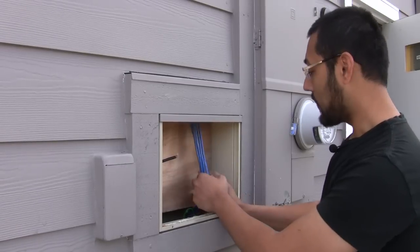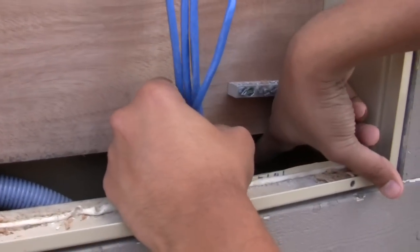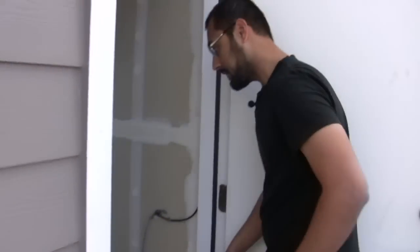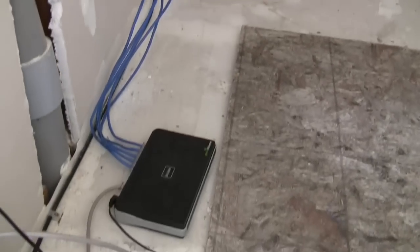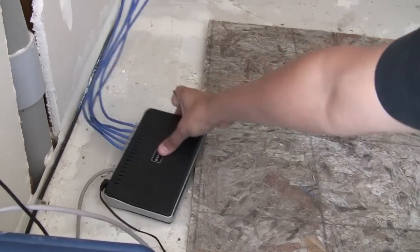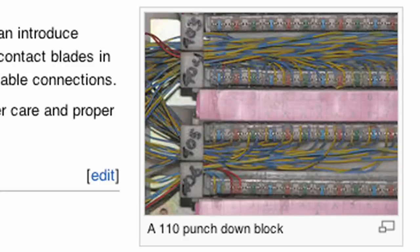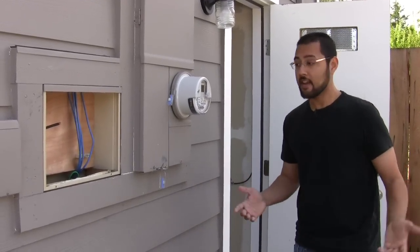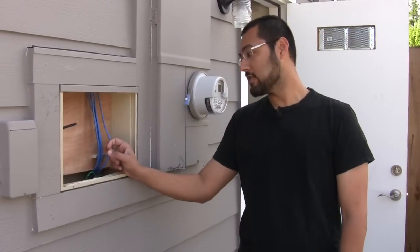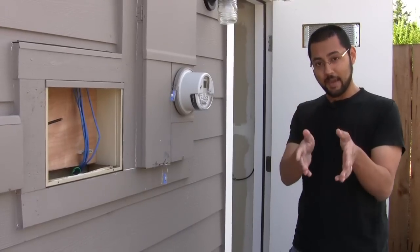What we did was make a hole and route the cables into our boiler closet. Here are five cables going into our switch. In a perfect world we would use a punch down block as a tidy way of keeping our Ethernet organized, but we decided to use a switch because we had it handy. With each of these cables, we terminated it using a modular plug. We've shown how to do that in previous episodes, so we're going to show you a clip on how to make an Ethernet modular plug right now.